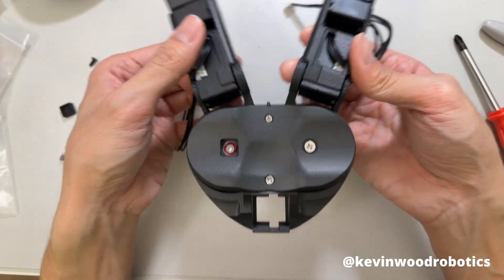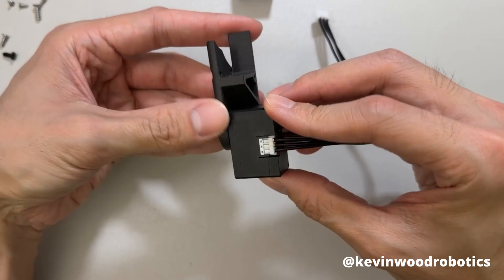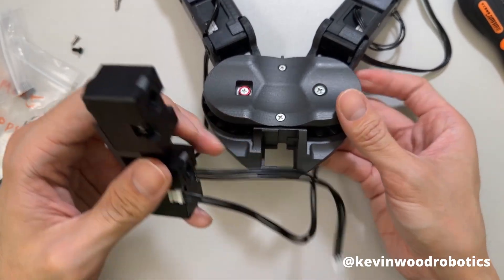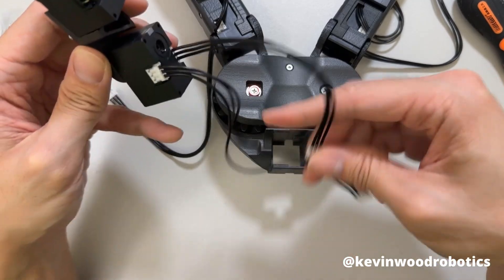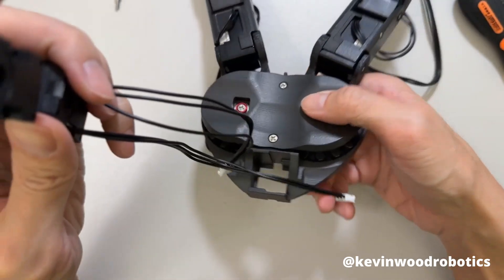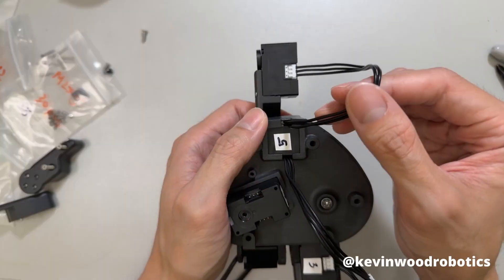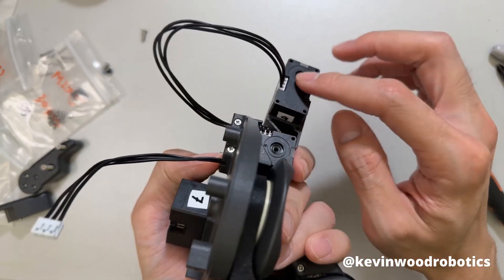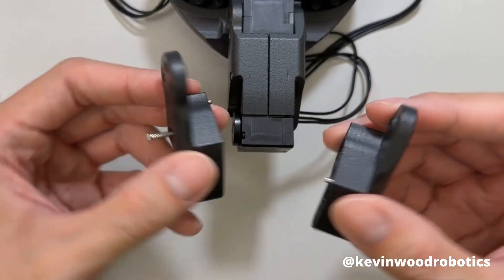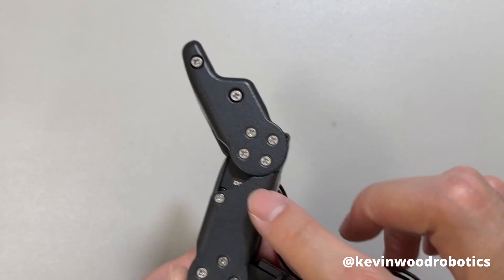Try back-driving the fingers to see how it feels. If it's too tight, try loosening these screws. Now take the thumb middle phalanx, assemble ID 5 on the bottom, and then assemble ID 6 on the top. Taking the thumb assembly, insert the cables through the base — there's a short and long cable. The long one is facing you, so pass it through the channels here. The cables bend and wrap around through the channel and come out the other side. Connect the long end of the cable from ID 5 to ID 6, close it off with this piece, add two M2x12 screws and the idler screw. Use the dowel pins to align the final two thumb pieces and close it together, securing with four M2 screws and the idler.